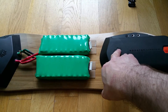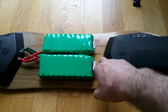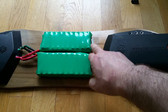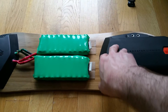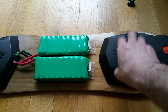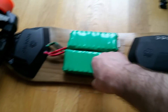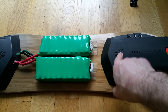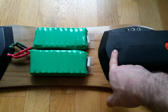Other people have asked in the comments why I didn't put a BMS on each pack. Putting a BMS on each pack would actually create a conflict between them and could confuse them, so it might not even work properly. Having only one BMS controlling all of them works perfectly because they're all in parallel. If you guys have any other questions, comment below and I'll see you next video.